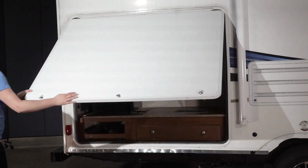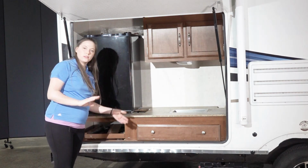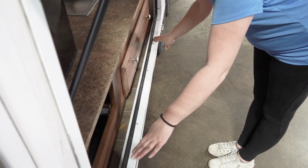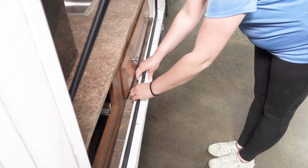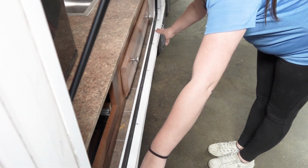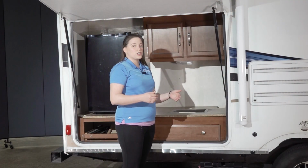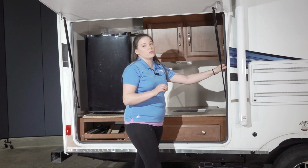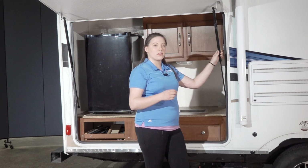And when you open the door, you can see that this frame is slightly twisted and angled forward. What I mean by that is that the outside corners here are sitting more flat than this inner section here, and when this is tilting forward, it'll create a bad seal in the center, whereas the outside will have a good seal because there's more contact with the sealing foam. That's a good indication that it's not installed square, so you'll have to remove the entire door, shim where it's appropriate, and then reinstall the door following the squaring guide on the LCI website.